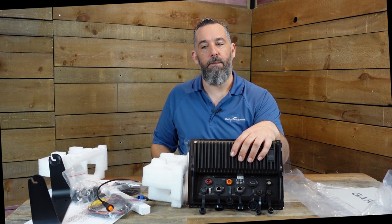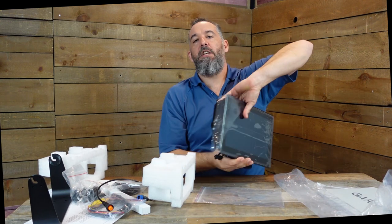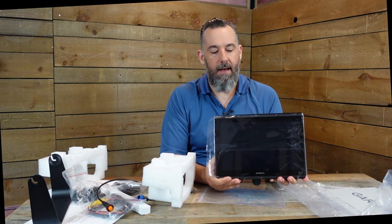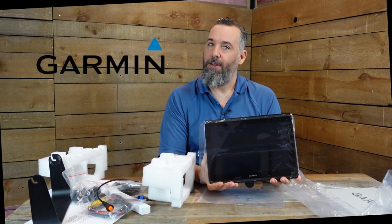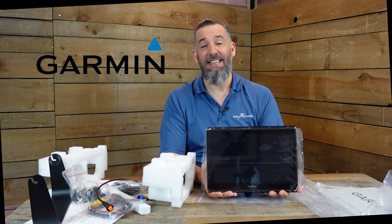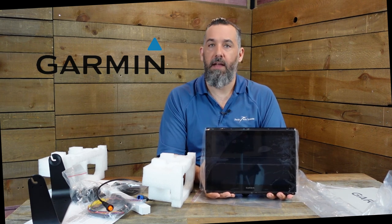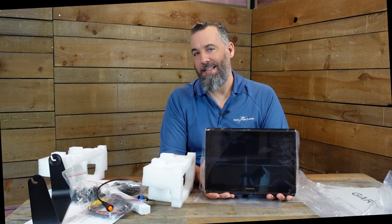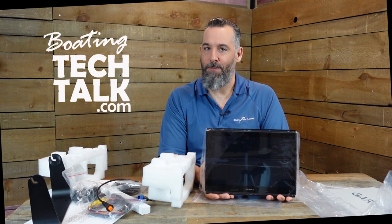I really believe in grounding all these displays - it makes the ghosts disappear, so to speak. This is the Garmin 1243 XSV: an awesome screen. You can network multiple screens to it, network a radar to it, connect a sounder, it's got built-in GPS, NMEA 2000, J1939 - it's a computer. When investing in a new screen like this for your boat, I tell people it's at least a 10-year horizon as an investment minimum - most of us it's 15, and some 20 to 25 years. Do your research, educate yourself, and then decide.